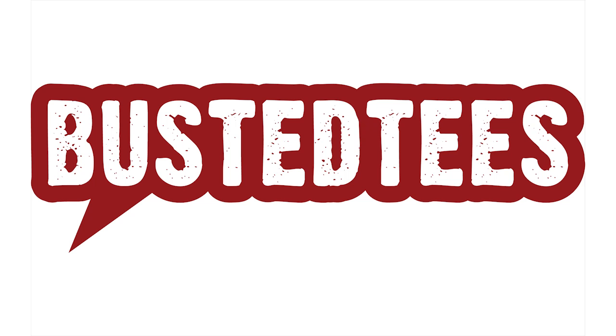This segment of Hack 5 is brought to you by Busted Tees. How is this as far as in the eyes of the FAA and the FCC? Well, as far as legality goes, because the USRP is really the only questionable one, and we've configured it to operate on 925.2 MHz, which is within the 33-centimeter amateur radio band, and I'm a licensed ham radio operator, so that makes it legal as long as we transmit my call sign.